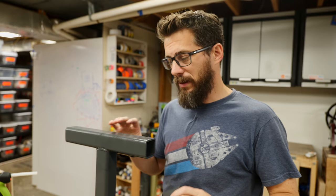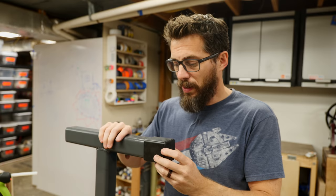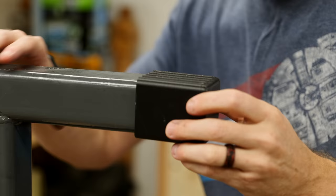After a little bit of filing, I got those pins to fit in there nice and tight, so this thing is held in place just fine. The last thing is to add some feet to the bottom of these tubes so this metal doesn't tear up the mats or the floor in the gym. We 3D printed some little caps that are going to go right on here. There's a little bit of gap on the inside of them just so we can get them on and off, and to fix that I'm going to add some hot glue on the inside before I put them on. That will keep them in place just fine, but if I ever need to replace them I can easily pull them off.